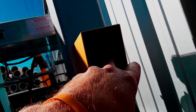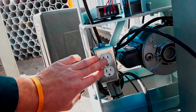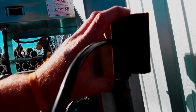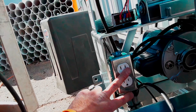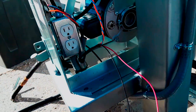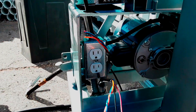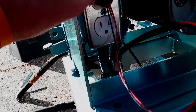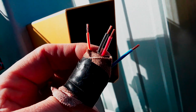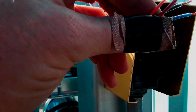Now we'll strip this wire back, expose the bare copper, then put the printed circuit board in and make our connections in the housing. We're doing a 24-volt AC power transformer here — hooking this up in what EMX calls configuration zero, which is a normally closed relay. They recommend 24 volts AC for that. I've got my transformer here and we'll wire normally closed and common up on the circuit board. The orange and blue will feed up through the holes into the control housing; the red and black will go to the transformer for power.